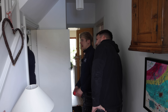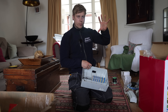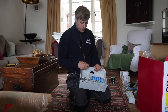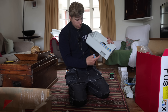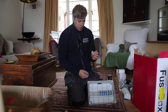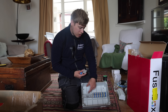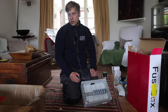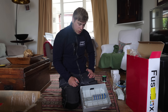John, that looks epic! I'm just getting the IP box ready with the din rail. Where there were three or four boards on different walls, John's going to take some trunking up to the top and around to the new double stack - so some of the cables need to be extended. I'm prepping this up: cutting the din rail to size, putting in all the din rail connections, cutting the entries either side so he can just mount it on the wall. This time we haven't made the mistake of using the earth connections, because they carry the metal through onto the clip which clicks onto the din rail and ends up shorting all the earths together - so we've gone with the same plastic ones we're using for the line.